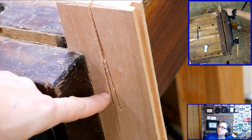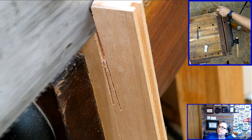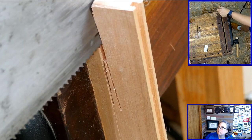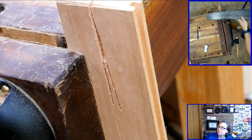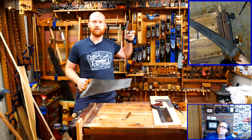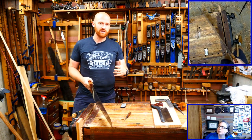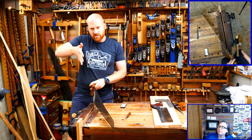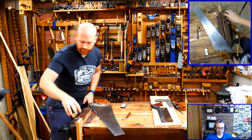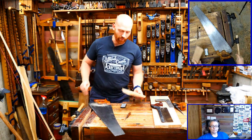It's relatively easy - if you see yourself going off course it doesn't take much force at all to just twist the saw a little bit and use it to scratch the side and bring the cut back on course. You're thinking of the saw as a file rather than just a saw - use the set of the teeth to bring that curve back into line.